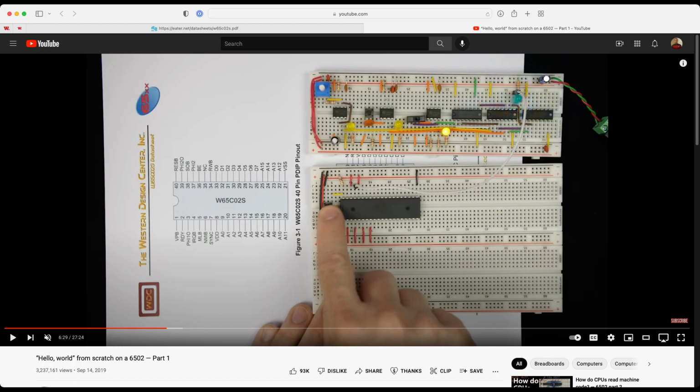You may need to look at the thing, and let me just sketch on the board what I mean here. You've got your LED, and the resistor is plugged into one of the pins and goes to ground. Therefore the other pin is the long one. You probably can't tell what's long or short when it's actually plugged into the breadboard. But you want the wire, the white wire in his picture, to be coming from the long side of the LED, not the short side. Does that make sense?